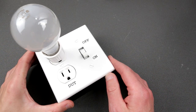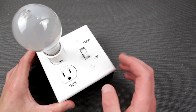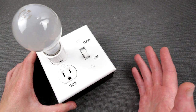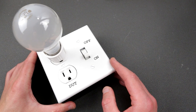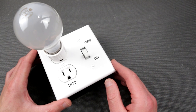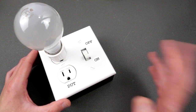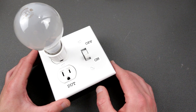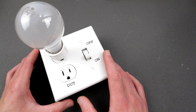Hello, welcome to Incidato Electronic channel. Today Uncle Misha will present his version of a dim bulb tester. A dim bulb tester is very useful when you are playing with old gear, just to make sure it's not going to let out magic smoke when you plug it into the power outlet. It ensures there is no short, a bad fuse, bad capacitor, or issues with a switch mode power supply.